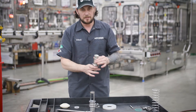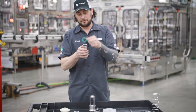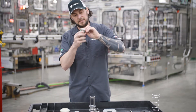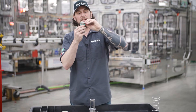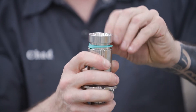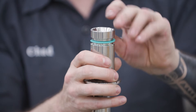Next I will take my CIP-able sleeve and I'll put what's called a flip-flop seal around here. There is a little track for this to actually sit in, so it doesn't sit flat like a rubber band — it actually fits around in a little groove.